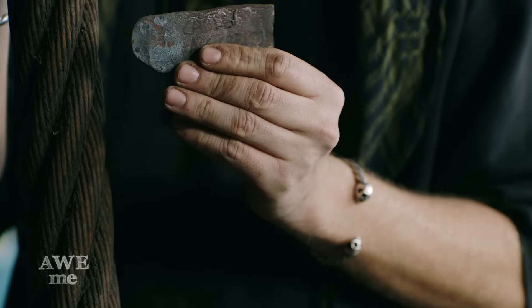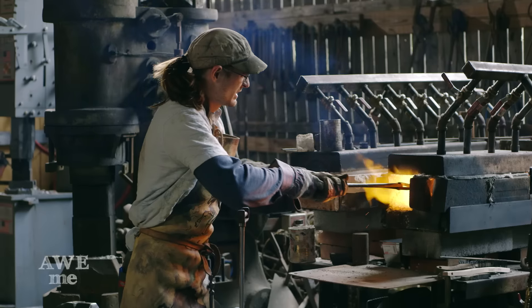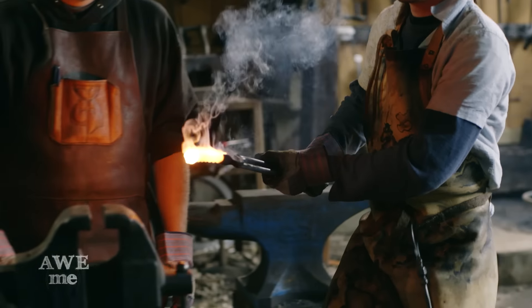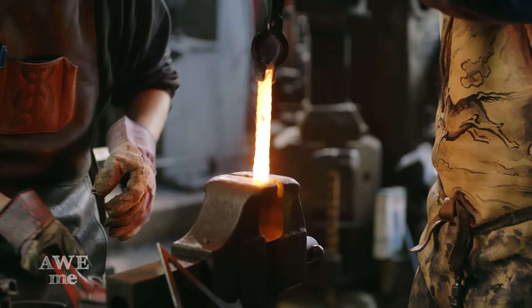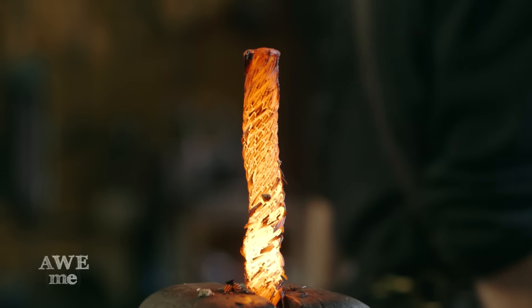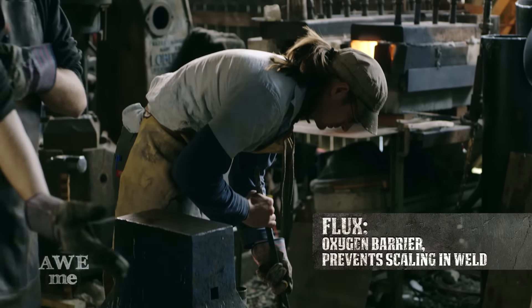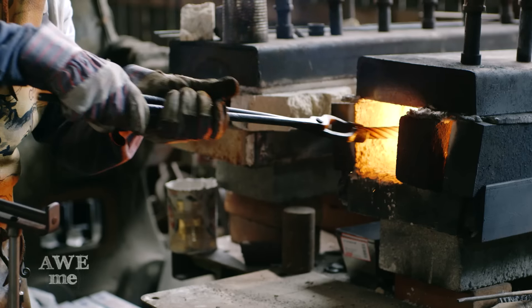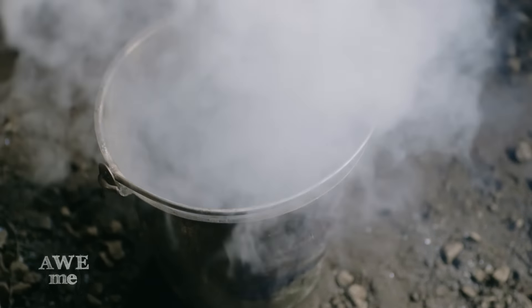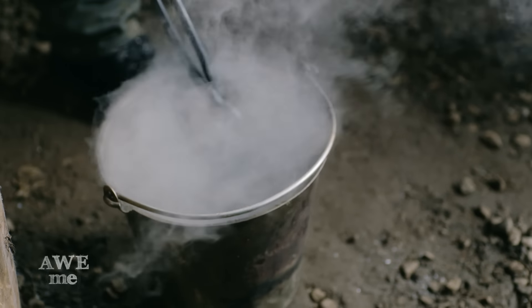This three-quarter cable that we'll be forging into our blade came from an overhead crane. After Kerry welded the ends of our three pieces of cable, we twist them tighter, which actually begins the forge weld. What Eli is doing is he's making basically a slurry of borax — we mix it in some water so that all the borax penetrates into all the crevices you want. This really helps us out a lot, specifically with the cable Damascus.